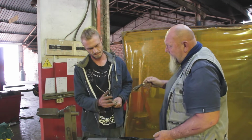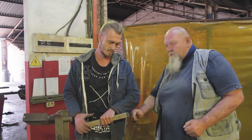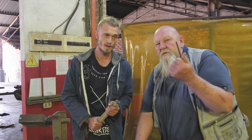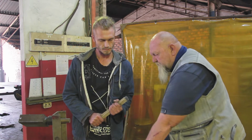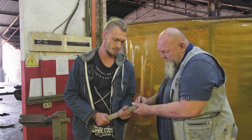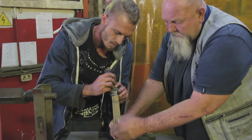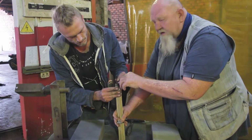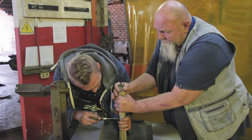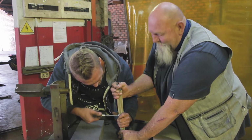Okay guys, as you can see, the electrode in this rod is way too thick to fit in the torch, so we're going to have to put something in there. We're going to use a standard 6mm bolt and tie up the ends with a standard hose clamp. We're putting in two clamps. Once we start welding, we're going to get heat. If we don't hold the rods together at the bottom, they're going to splay out. We're not going to get a cohesive weld. We hope we're going to get a weld.